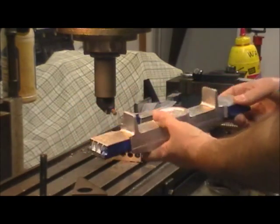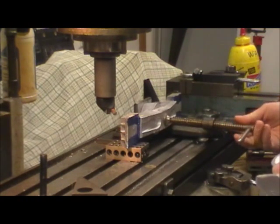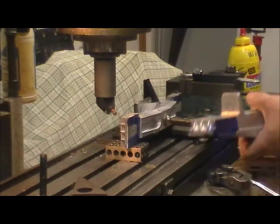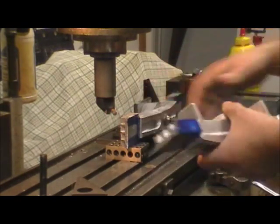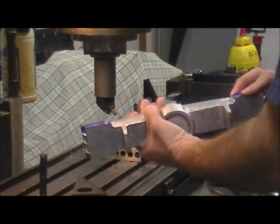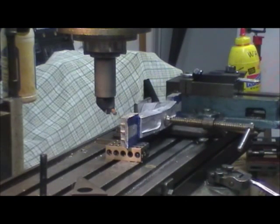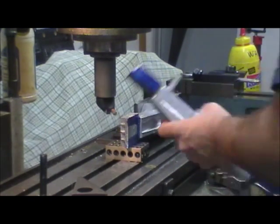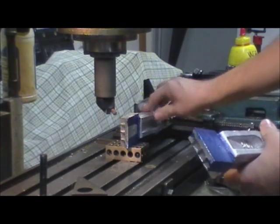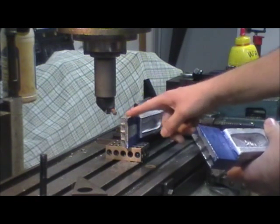So that's what we're going to do. You can see I have this clamped up — it seems to hold a little bit of vibration, but nothing, not too bad actually. The cut is nice, so it must be a decent setup. So we're going to continue on. I'm trying to get as much of the fly cutter work done as I can, and then later on I'll be coming back — I think I might use the same setup — I'm going to end mill out the groove that's in here for the bolster.